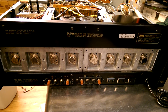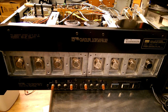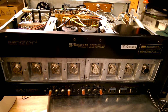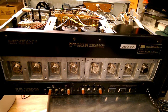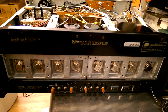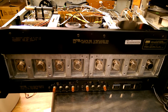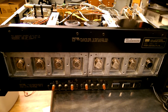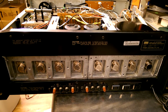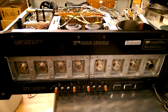Aside from the two little silkscreen markings being wrong and this thing being picky about bias, that's really the only thing you've got to watch out for in the Sansui G9700 and G8700. The only difference of course is the G9700 is a 200-watter and this is a 160. They're the same otherwise. But that's really the only thing that's difficult about this unit — the rest of it is just time. There are so many boards to solder and so many caps.